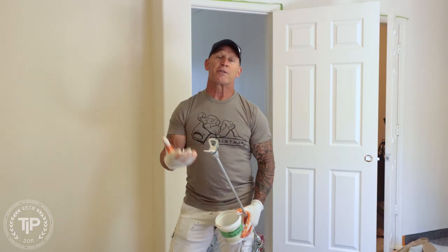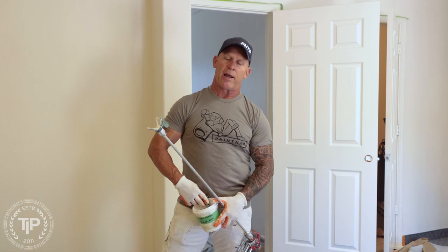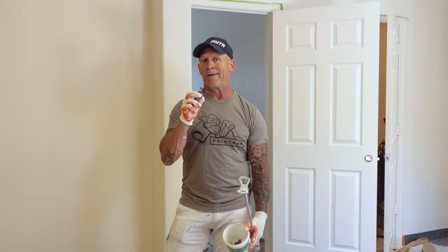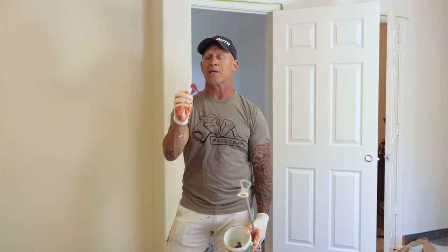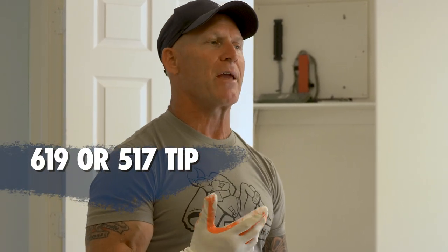The next thing I get asked is what do I spray the body of my house with, or the walls inside my house. I'm going to talk about production tips. We've got a Titan production tip and a Bedford production tip here. I typically spray exteriors with a 515 tip — that's my go-to. It's essential to choose the right tip size to control overspray. Bedford tips are the most cost-effective production tips right now, so I use the black Bedford 515. If I can't get a Bedford, I use a Titan red production tip, which gives a nice square edge. For interior walls, I'd kick it up to a 517 or a 619.